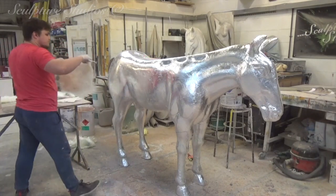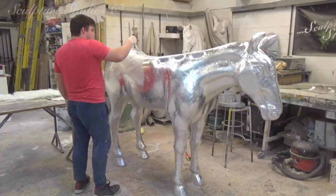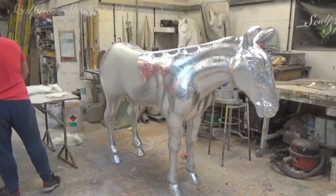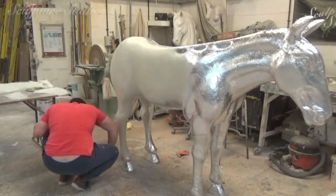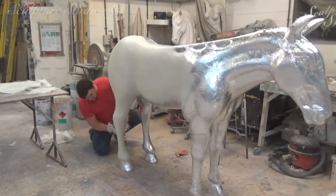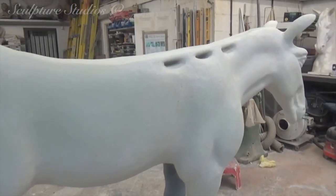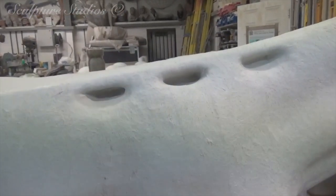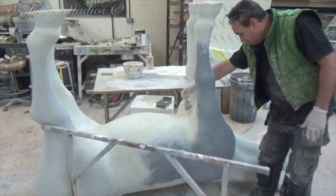For the zebra, I'm going to try and keep these glass fibre layers as neat as I can, to make working up the surface as easy as possible later on. The side of the zebra we're looking at here will be the upstage side that the audience can't see, and we've carved little grip points at the top of the shoulder for the actor to use to climb on top. The glass fibre needs to be kept really neat in here also, so there are no uncomfortable sharp points that can cause injury. We're going to be installing some metalwork into the bottom of the legs so that this can be secured down to the table, and the top half of the legs especially need to be built up with enough glass fibre to take the weight of the zebra body as well as the actor sitting and laying down on top. Multiple layers of glass fibre also ensure longevity and durability, as this will be used for numerous performances.